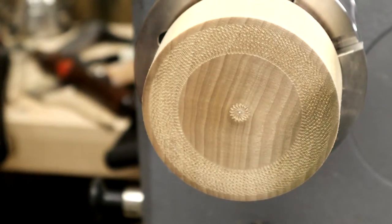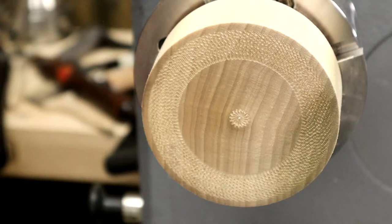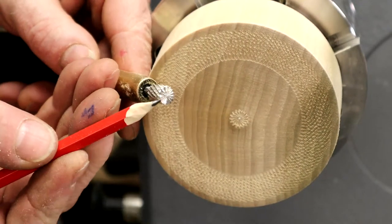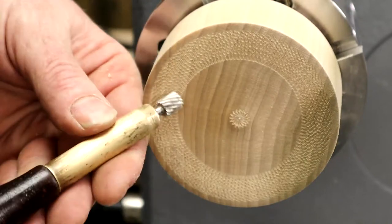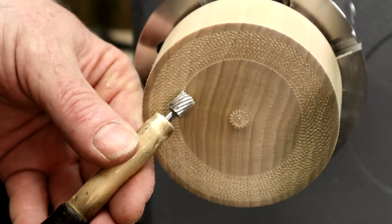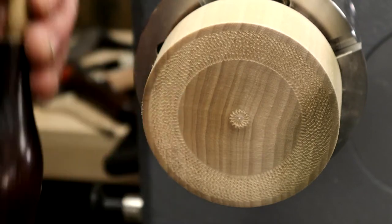Now we have on there quite a textured effect. Colwyn can see it probably better on what he's got as a screen. I'm hoping that shows you get a crossover effect that takes a little bit of thinking about. Approach of the tip is important. On what we've just used there, we're using a pencil corner, right on the edge of the tool. It can be a little bit tricky to come on. If you come on too high, it wants to kick it out. If you drop your handle back too far, it can be quite scary to start with. You'll find there's a bit of resistance. It's almost having that little bit of nerve to keep it going, see what happens.